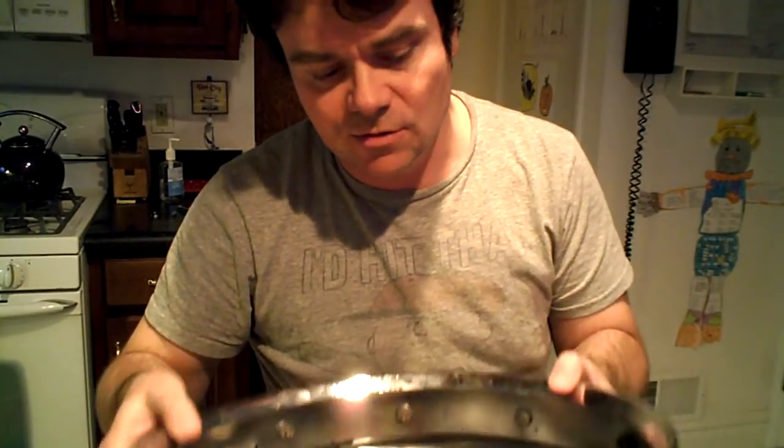There are telltale signs that it's brass. A great plating job is one indicator. Brass, which is copper and zinc, takes plating terrifically because you're flashing it with copper first, then nickel, then chrome — it holds plating well. The aluminum ones typically don't, though sometimes they do and sometimes they don't.